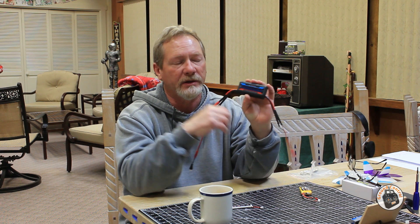I also paid attention to the amp meter, and it was showing zero before I powered up the motor — which is correct. I think that the amp draw this unit displays is going to be fairly accurate, accurate enough that you'll be able to pick the right speed controller. And if you know the rating for your motor and you test it with this unit, you'll be able to stay within the limits.